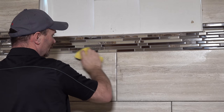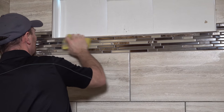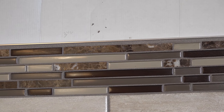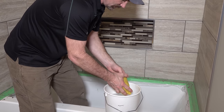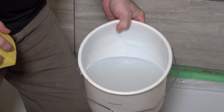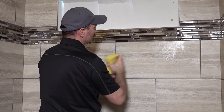I'm initially just trying to get the bulk of it off, smoothing over the joints to feather it out and getting the bulk off the surface. So then just go back to your water and rinse your sponge out as well as you can. Once you've basically wiped that wall once, the water coming out of your sponge is going to be fairly white — you can probably see the water's already milky. It doesn't take long, but you'll know when you've got it too dirty because you're not going to be cleaning very well, and it's just time to change the water out.